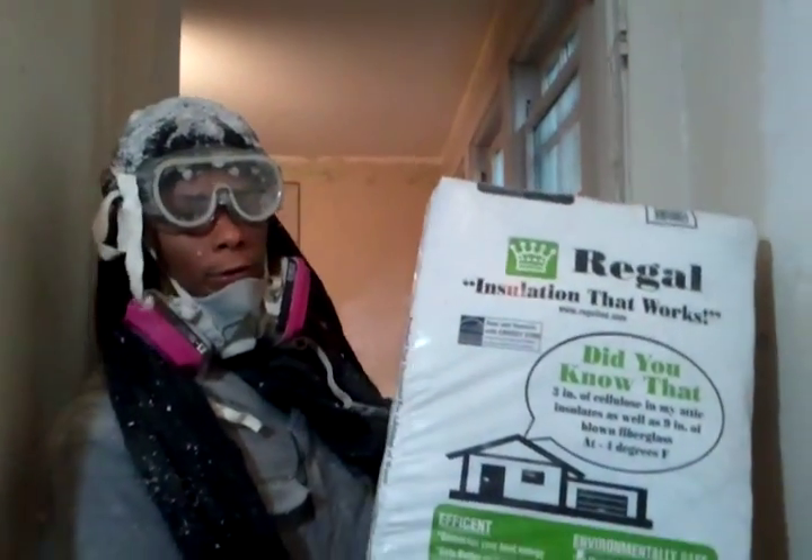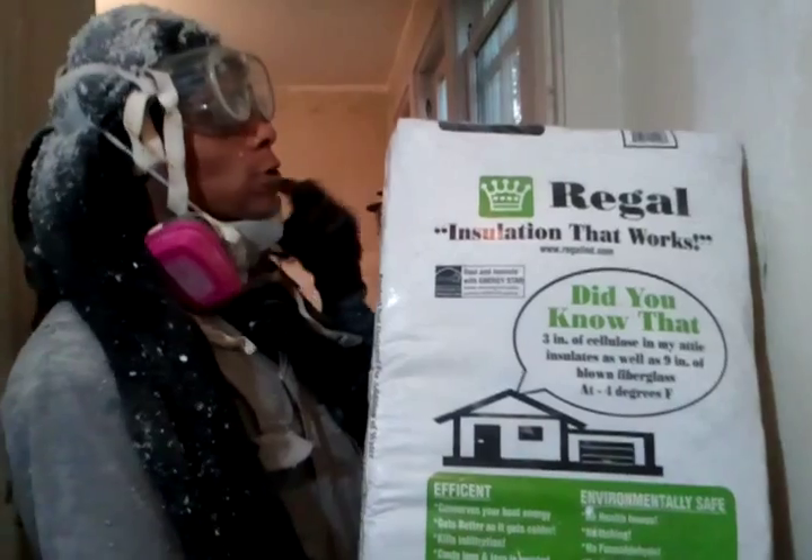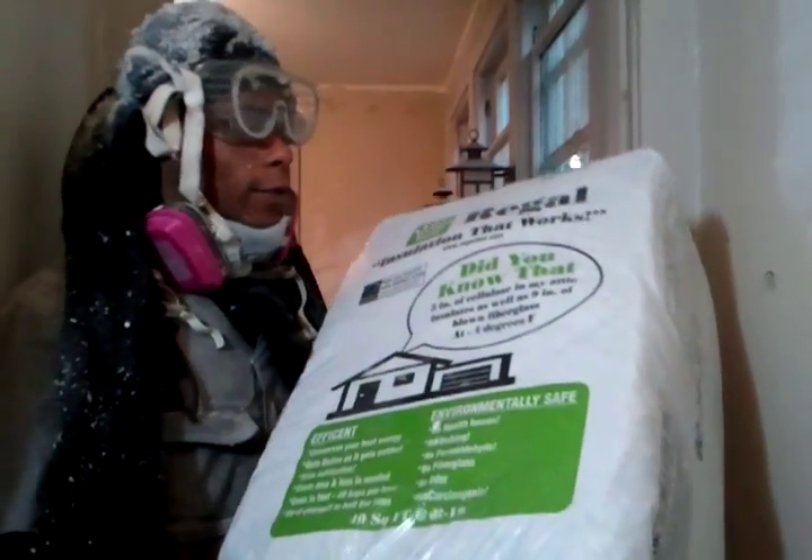Now, this is what you're going to be putting into the wall — that's what we chose. One of these bags can get you 40 square feet of coverage, so that gives you a good idea of how to calculate how much you need. What I did is I measured the walls, measured the doors and windows, subtracted the doors and windows, and then came up with how much square footage I needed.